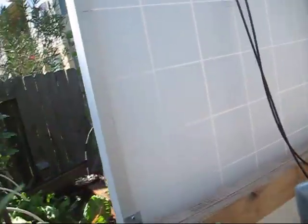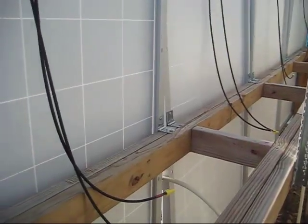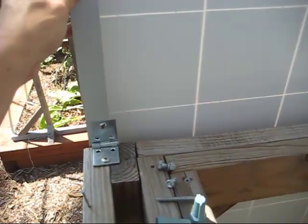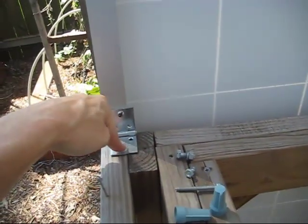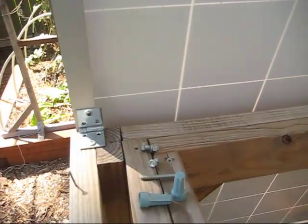One nice thing about these panels is that they already have holes drilled in the back — it's one reason why I like them a lot. This hole will just come right back down here and land right on that, lining up with those holes. Then I have my nuts, lock washer, and bolt that will secure that on all of these going all the way across. You may also notice that I have hinges here. The reason why I have hinges is because if this was a fixed angle, it would be very difficult to get a screwdriver or drill bit in there. So by putting the hinge here, I attach that, lay this on here, and then I'm able to easily pull this back and get it set up on the supports. The hinges worked really well for this particular setup.